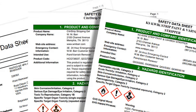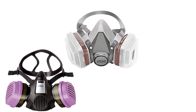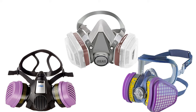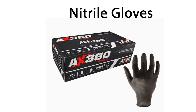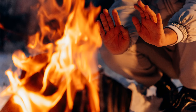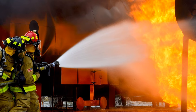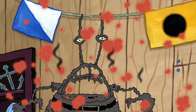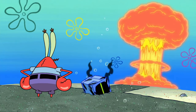In reading the safety data sheets for all three products — Quickstrip, Watco, and Citrus Strip — I found that they may cause respiratory problems, cancer, fertility problems, and damage to an unborn child. A chemical respirator and goggles should be worn with all three products; a dust mask is not sufficient. Gloves resistant to chemicals such as nitrile rubber or neoprene should be worn. You should also keep them away from heat, sparks, and flame, as the vapors may cause flash fires or ignite explosively. Use in confined spaces can cause vapors to build up and explode if ignited by an ignition source. That's why I took all of the trash out immediately after I finished, because I didn't want to leave it in a confined space for any period of time at all.